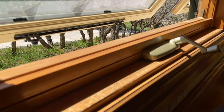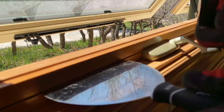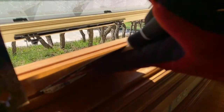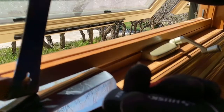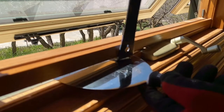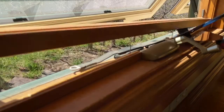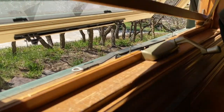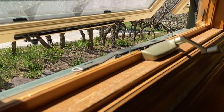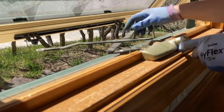Then you're going to remove the sill cover. Be very careful when doing this because you don't want to gouge your wood. That's why we're using a putty knife and a thin crowbar — the putty knife helps protect the wood, as there are finished nails holding it down. If your wood is brittle, you can bust it easily, so only pry where the wood is thicker. If your windows are painted, you might need to score that line before removing the sill cover.